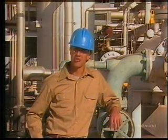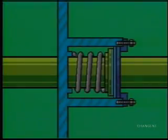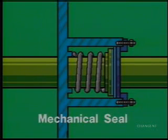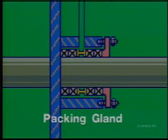Gear pumps usually handle hydraulic fluids or oil, and their bearings are generally lubricated by that substance. If the fluid is non-lubricating, seals are used with some type of external lubrication. Those shaft seals can be either mechanical or packing gland types. The choice depends on the kind of fluid being moved, the pump's design, or the type of service.